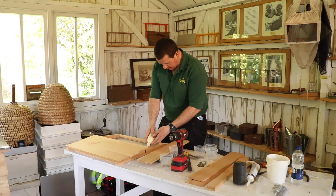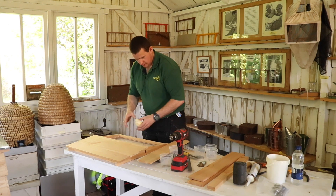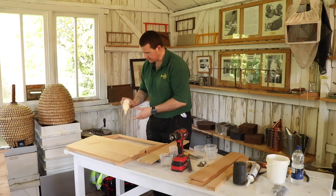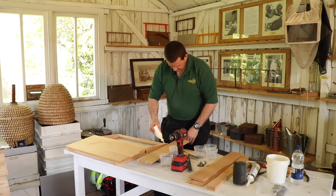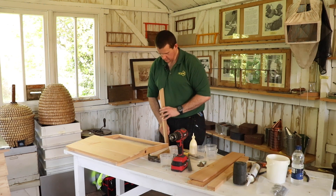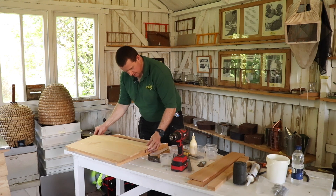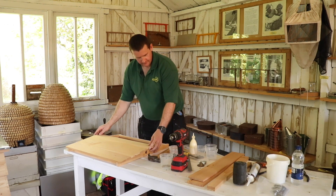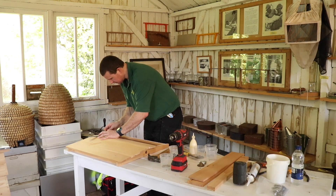Put a little bit of glue on there on the join. As you can see, that's where your other board's going to run, so glue there, and then glue the rest of the frame — gable end and the side — then put that on there like that, agitate it in. You've already got your position again so you can just level that up, and then mirror the line that you've drawn on that first one onto this one.